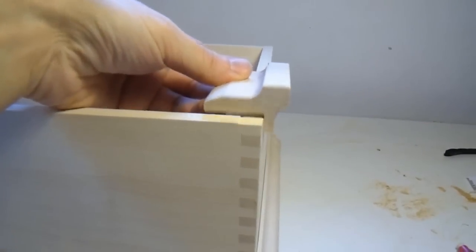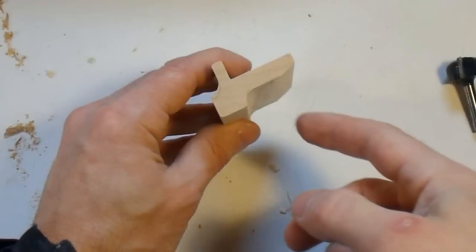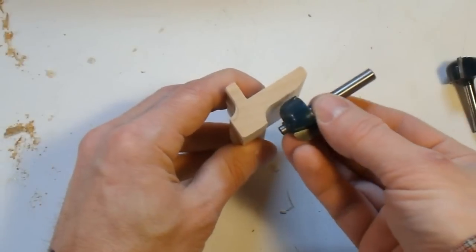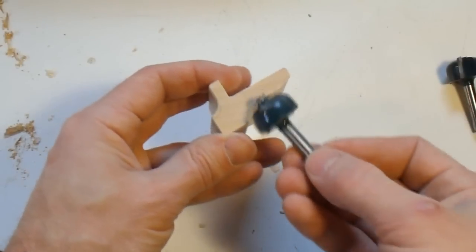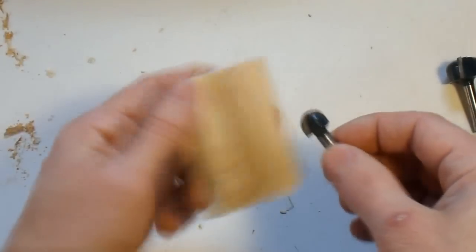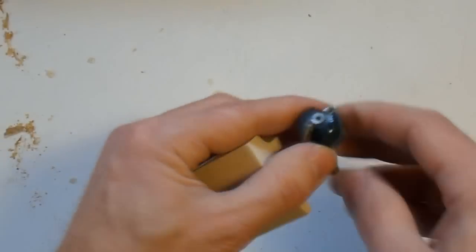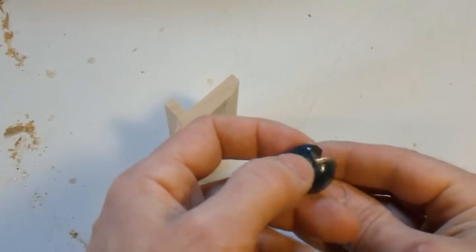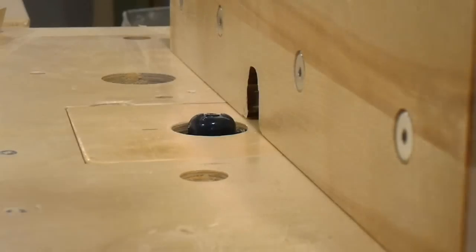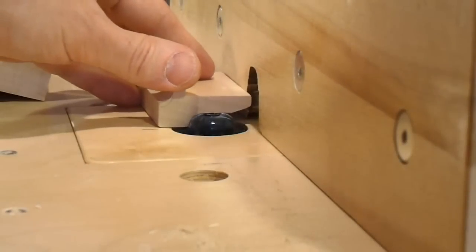This is the shape of molding I want to create for the top of the box. It'll sit over the edge, and the lip will cover the lid that goes in there. Inside I've got this inside curve — I first thought I should cut it one way, but the problem is I'd have to extend the bit way above the router table, so it's better to come at it from below. Rather than using a ball nose cutter — since the tip doesn't make a good cut — I've taken one of the round-over cutters, removed the bearing, and ground it flat on top so I can reach in from below. I've also already cut a rabbet in the stock so the bit only has to cut that last little bit of round.